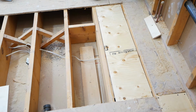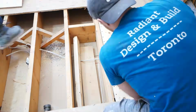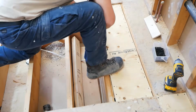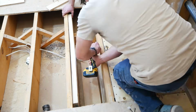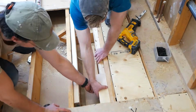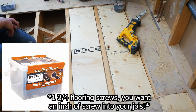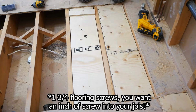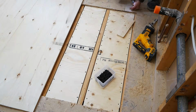This way, we now have the 1.5 inch, as mentioned, underneath each side of the existing subfloor. And that's going to create a real tight bond and keep everything nice and secure. The next few cavities really working out the same as the first one. The type of screws we're using are 1.5 inch flooring screws and spaced out no more than 6 inches apart, although oftentimes you'll find that we're putting even more, as again, overbuilding is always a good idea.